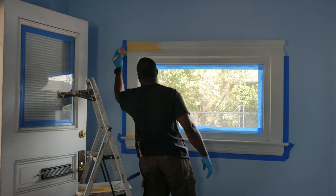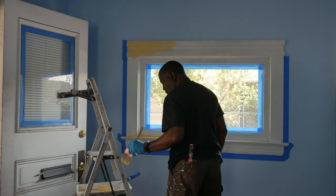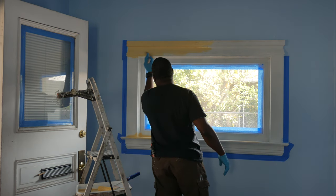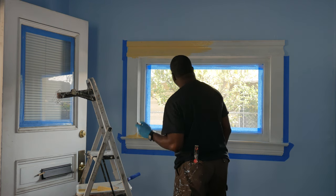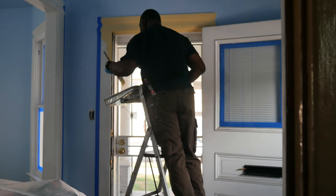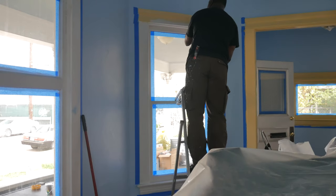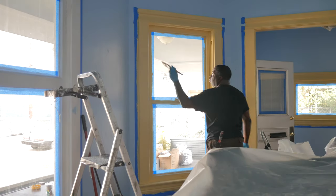Now I'm doing the trim paint, which will also take two coats. I use blue tape to define my lines since I'm on a bit of a schedule, though when I have more time I'll freehand the edges. When I take the tape off, there's always some paint that gets underneath, so I'll have to go back and tighten that up — possibly touching up with the blue paint, then the yellow. Once both trim coats are done, I'll take some photos so you can see the finished result.